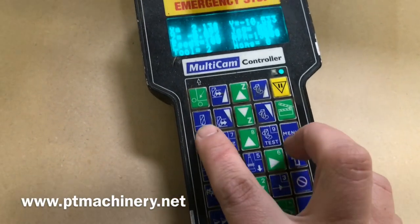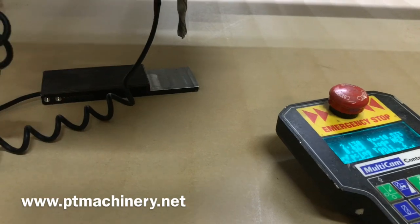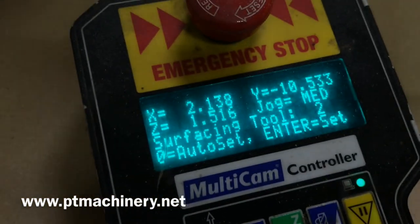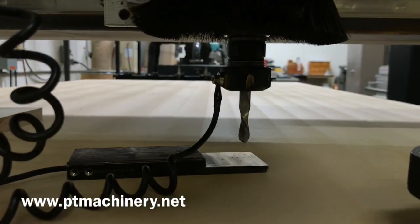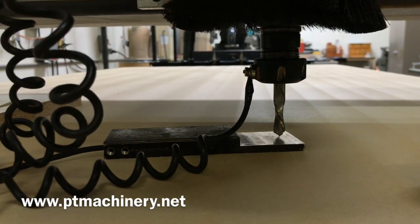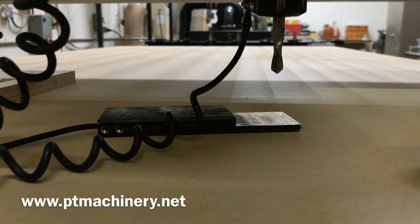Now all we have to do is go to the menu and set surface — it's just this button right here. If you'd like to surface tool 2, enter for yes. I'll get a little closer and position manually where I'm comfortable. Then when I'm ready, it's just zero to automatically set — so we'll hit our zero button here, and allow it to press off automatically. As soon as it sensed that block, it automatically reversed and went straight up to our tool lift site. That surface is now set.